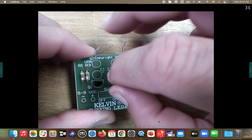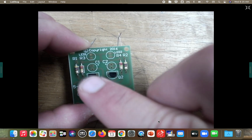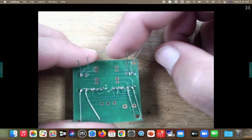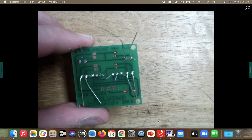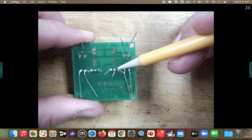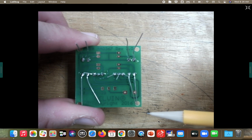We were also able to solder in our transistors going in Q1 and Q2 with the flat side facing up. When we flip over our board here, guys, we left all of our legs for a reason. Okay, we will leave these till the very end. Test it out in case we need to change some stuff, and then snip them off if everything's working correct. We are really kind of conscious about building bridges here. Okay, you should see green in between each one of your welds on every single leg that you have going across there. Everybody good? Everybody understand?